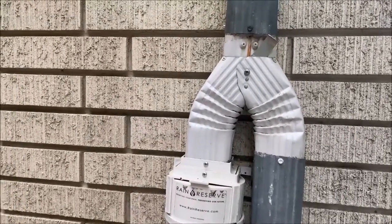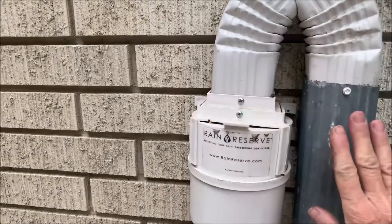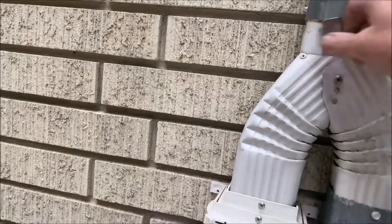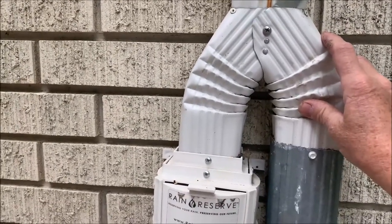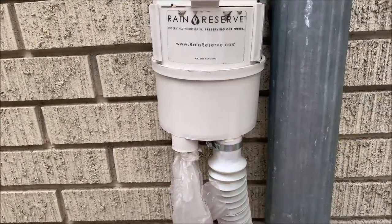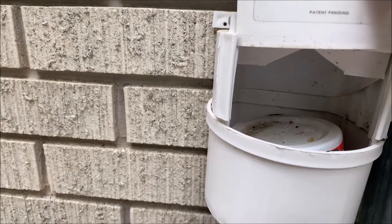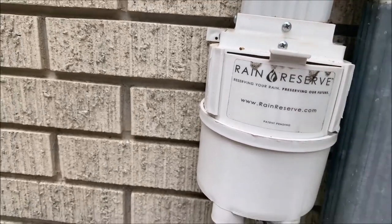So this is the beginning of one of my water systems. This is a switching valve that switches it from the rain collection system to just the drain system. When the rain collection containers get full, you have to have somewhere for the water to go, and you simply operate it by moving this little switch. I'll try to put a link to this mechanism in the notes so you guys can access that. This thing hooks to this hose and has a little door so you can go in there and clean out the leaves and stuff. I ended up putting a cottage cheese container in there upside down just to make it function a little better with some notches in the bottom of it.